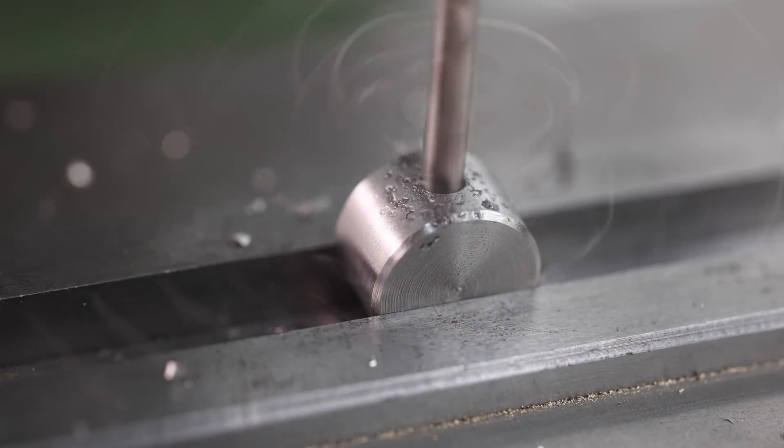Now I need to do the same for the cam. Because the cam is eccentric it's going to start engaging at its lowest point, so I'm going to place my lever at the thickest part of the cam so that we've got enough leverage to lock the mechanism. Unfortunately I've drilled a little bit too deep and I've broken through into the flange recess, so I've glued it in just shy of the full depth to avoid fouling the cam carrier. And now time for final assembly.